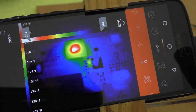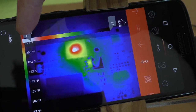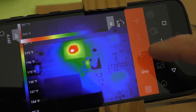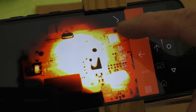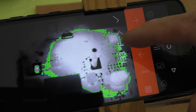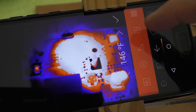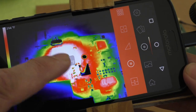This is called the span and level, and you can move these sliders to show what temperatures you want to adjust to. And then these are thresholds — above, equal to, or below — and you can scroll the temperature right here. There's the equal to and you can move the temperature right there. Here's the above. And down here there's the spot where you can move the camera around and it shows right in the center what the temperature is.